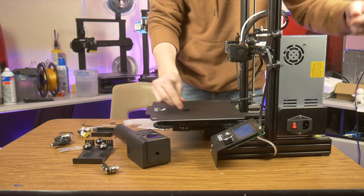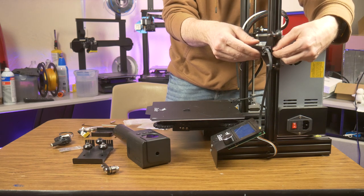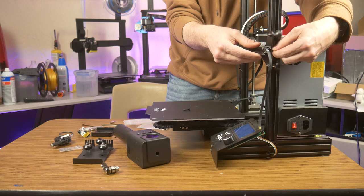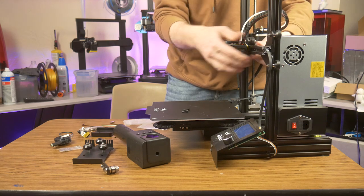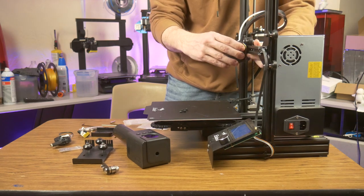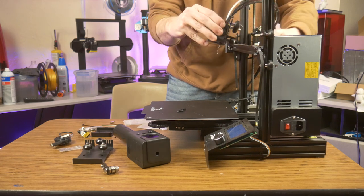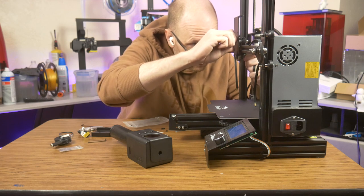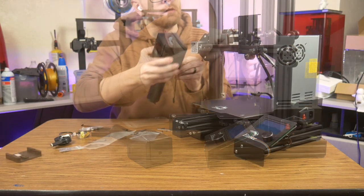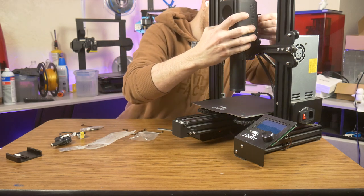I started by taking apart the hot end of my Ender 3 Pro. The standard setup has you remove everything from the Z-plate and attach the Z-plate adapter found in the Luckybot kit. I will be using the Z-plate extension, so that requires me to remove the whole Z-axis carriage and replace it with the one provided in the extension kit.